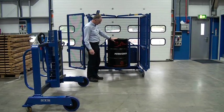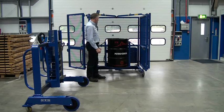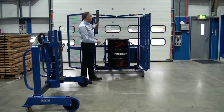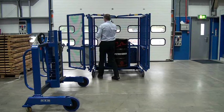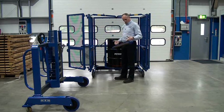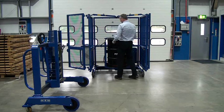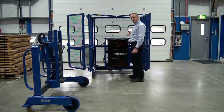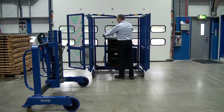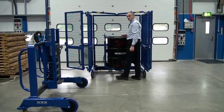The drum is now on the base plate. It's within the foot at the front, so it's completely on the centre line. We now take this beam here — we unhook the beam off the top. This is the clamping beam, which clamps down on top of the drum. Grab hold of the handles at the top and place it across the centre line of the drum. Then we fold up the locking bar and spin the nut down on top, just gently.